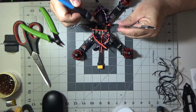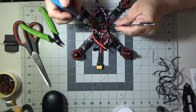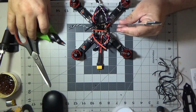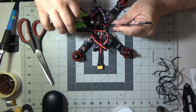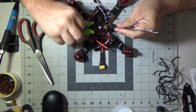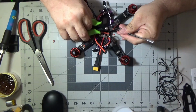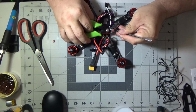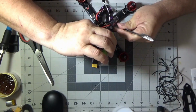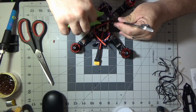And I have to fix this issue. That wire is sticking out there kind of weird. I even wind up having to cut it off right here because the wire is too long. So I cut it off, and then I do something stupid. Instead of retinning the wire and then putting it down, I try to just mash the wire down into the solder puddle. That doesn't work out too well, so then I wind up tinning the end of the wire in place and fixing it. But I get it fixed on there right. I don't leave any scragglers, but I should have taken my time and retinned this wire right here.